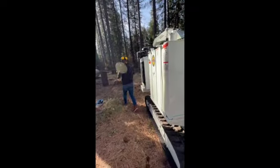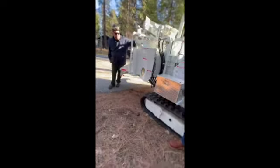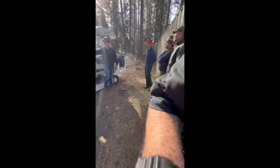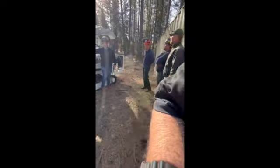So coming back, guys, this is going to bring us to our first greasing point. This is just running a hose back to that main drum bearing. This sticker up here indicates it. This is not a daily grease point. This is a sealed bearing on that drum bearing. Once a month, it's 8 pumps of grease. You have one here, one on the back side, behind those fuel tanks, which I'll mention again just so we remember. Once a month, 8 pumps of grease.